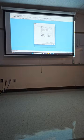Whenever you go to solids, then over here, this is easy money. The length is gonna be your X. So what is it? 5 inches. 5.0. And then your Y is your width is what? 5.0. Correct. And what is the height? 1.1. Very good, Mr. Corey. Excellent. 1.1. Why 1.1? Overcut the stock so you can machine it down.